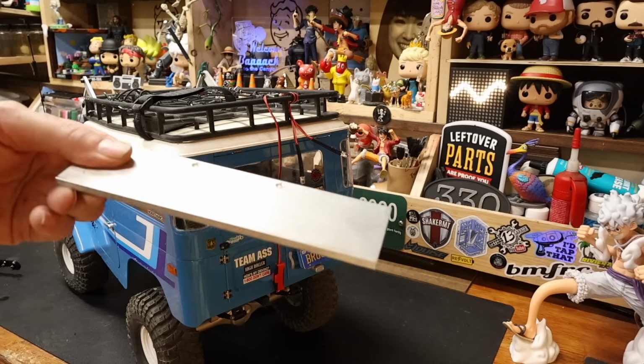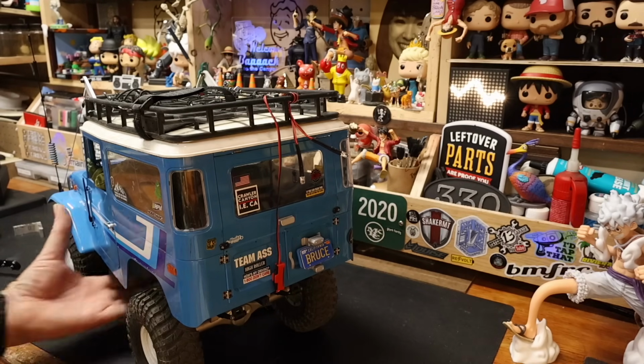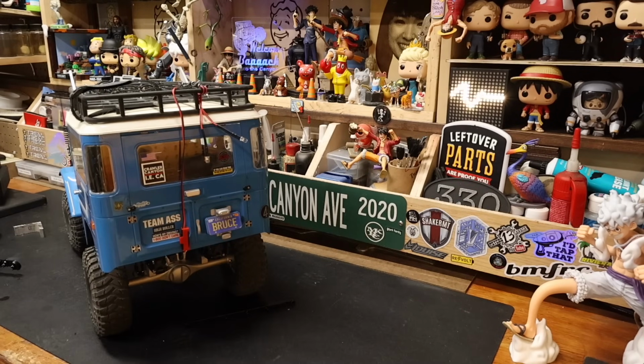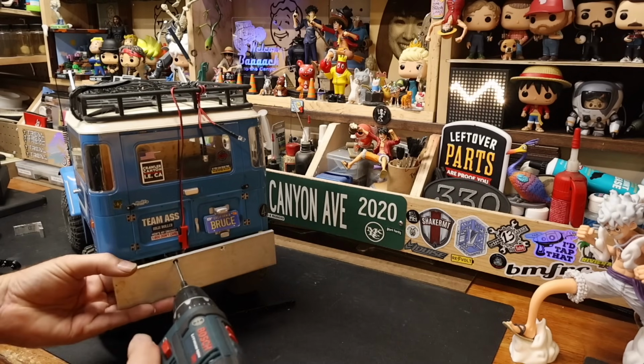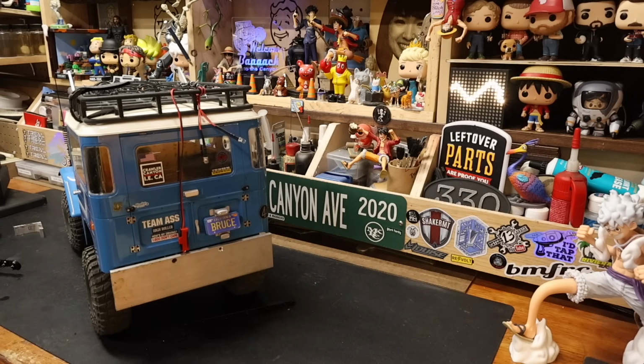Oh, I countersunk those because I don't want button heads on the bumper. For setup, we're going to use alloy M3x14 flatheads because I have a lot of that size. I often order replenishment packs from McMaster and I order the wrong one. I order the ones I don't need. I'm almost out of stainless 10s and I bought alloy 14s instead. It just has to be reasonably straight. And when that second screw goes in, we'll know if it is or not.